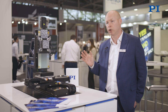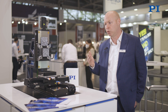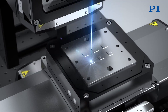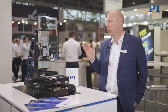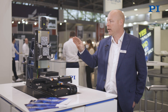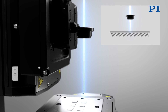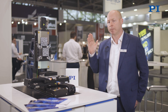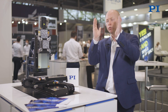If you already have a stage system in your process and your end customer wants you to improve the process by making the holes smaller and more square, then a device such as a piezo XY can actually do the job much, much better. The other thing we mentioned was about taper control. As the thickness of the material increases, a stage such as the PI V308 is very good at controlling the laser beam through the part, making sure that you have very square edges as you go through, instead of having a taper that limits the number of holes you can drill through the part.